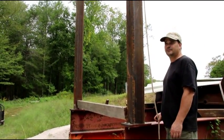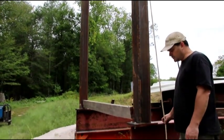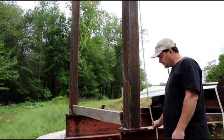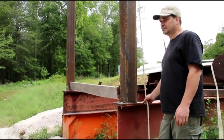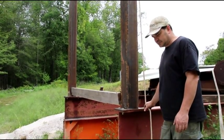I've been getting some guys that want to see some arc welding. So we'll do one side with the flux core. Then we'll switch over to one side with 7018, and we'll get this welded in there. And then I've got some braces going in, I'll show you that as well. But for now, we're going to get some tacks on it with the suitcase welder and the flux core, and I'll show you those going in.